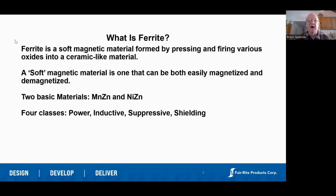What changed about our industry starting in about the 1970s was the introduction of switching power supplies, and now probably 60% of what ferrite makes goes into the suppression market — EMI suppression. The biggest godsend that ferrite ever had was the introduction of the switch mode power supply. I can go back to the 1980s: I remember my first 286 computer — every time I turned it on, it would wipe out the TV, the radio, everything connected to it. That switch mode power supply from China had absolutely no EMI filtering, and that started our whole real industry in terms of suppression ferrites.